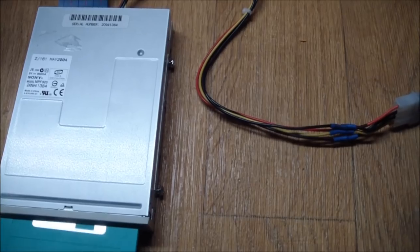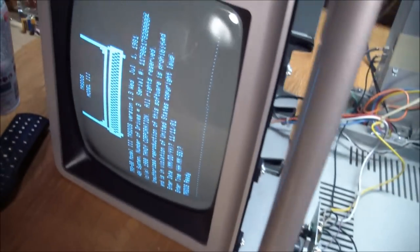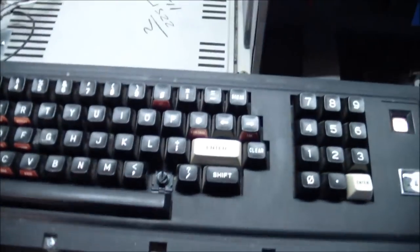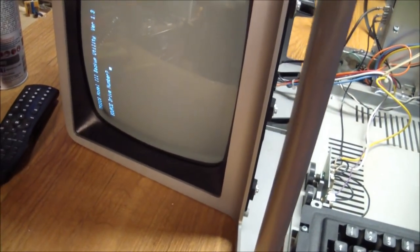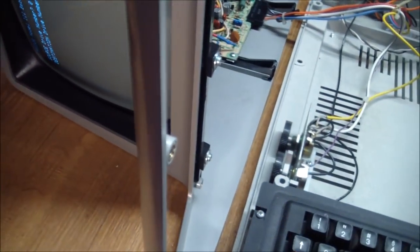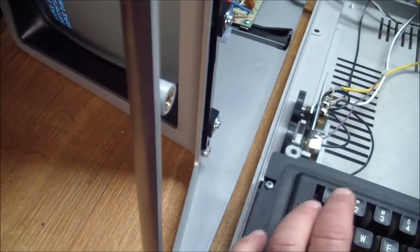So, let's give it a disk. I have TRS-DOS loaded, and what we do here is like an all-in-one thing. We're going to tell it to back up, and source drive number is of course 0, which is the internal first drive. Destination drive now is number 2, and source disk master password. Radio Shack was very security conscious.